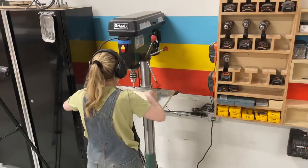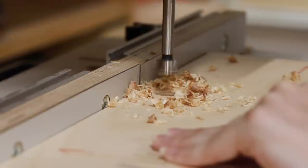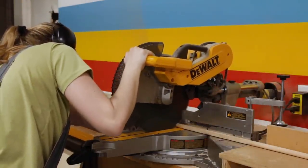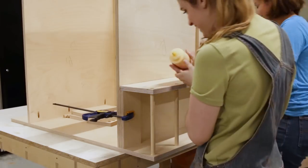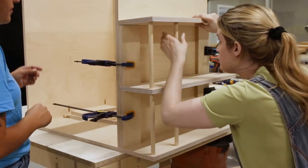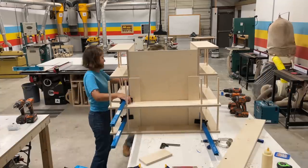Now that all the shelves were cut, I was put in charge of a beast of a drill press to make shallow divots in each shelf — these will be where the dowels sit so they stay secure. I drilled into the top and bottom of each shelf, except the top one that only needed one set. Then in a true moment of deja vu, it was time to chop the dowels. These are birch, five-eighths inches. Amanda put a block in place to make sure all the dowels were the correct size, and I cut them to nine and a quarter inch height. It was crazy how much smoother this went than the first time. Amanda and I became an absolute machine: I applied glue into the divots and added the dowels while Amanda added spacers to ensure the shelves were at the correct height, then secured them with screws. Repeat until the last shelf, then attach each shelf corner with a pocket screw.